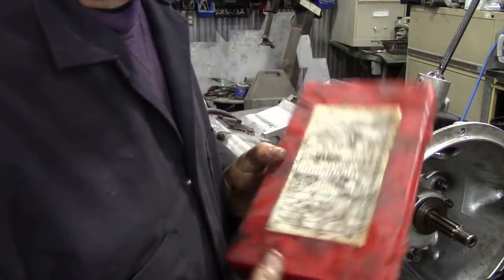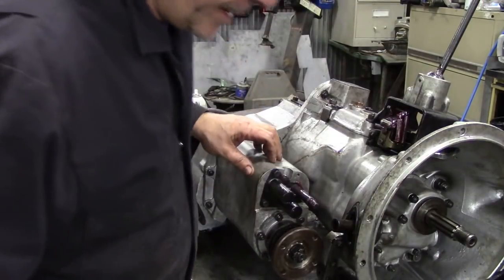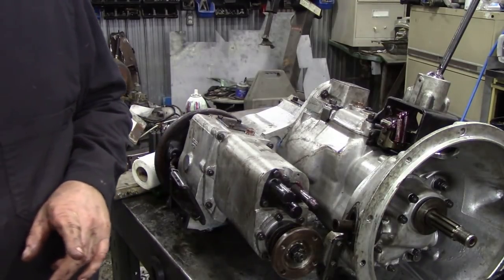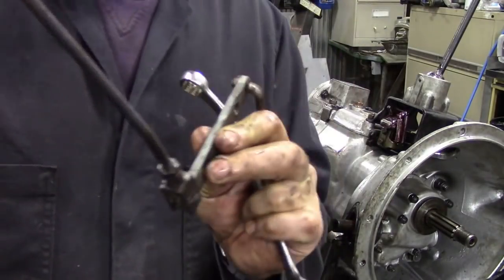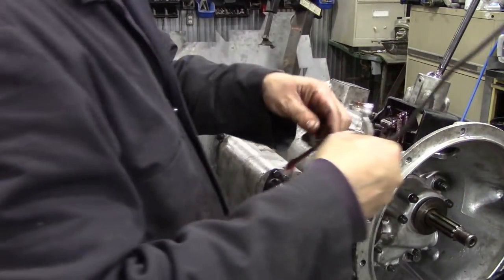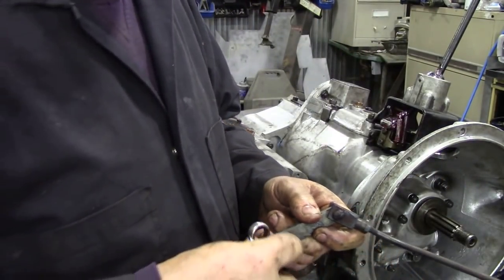Good thing to get, a set of universal O-rings. Get a set in metric, get a set in inch if you're going to do these type of jobs, because look at me, middle of nowhere, and that's what was really handy. Right, so now I'm going to salvage the linkage off the other one. So there's the linkage, because this arm here off the original vehicle was practically straight. So we're going to put some grease on there. Now observe inside here there is a little brass bush.